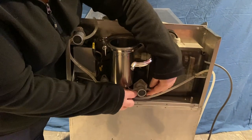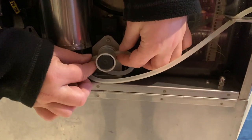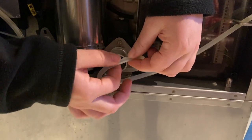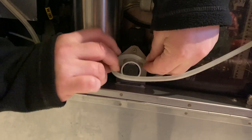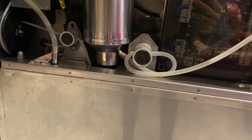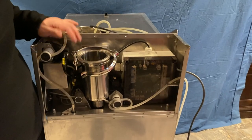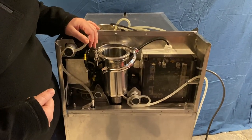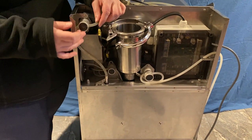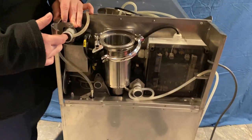The next step is to readjust the lines. As you can see, the pinch valve keeps the line in a permanent pinch, leaving a kink. I recommend moving it to a new position every milk test — just a centimeter or so each way — so it's not getting permanently kinked in any one spot. Do this with all the lines. The air line is not a big concern because it stays permanently open and only actively pinches when the robot commands it to do so.